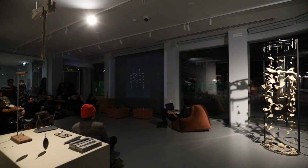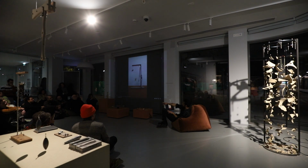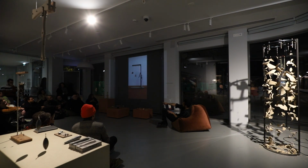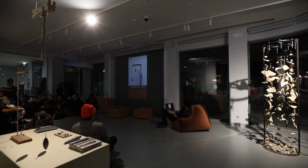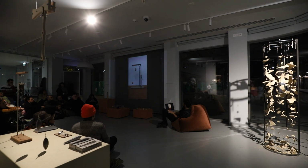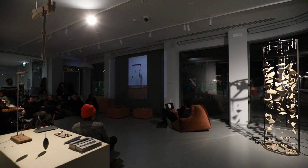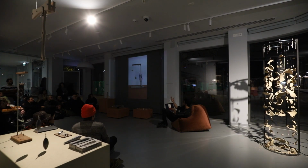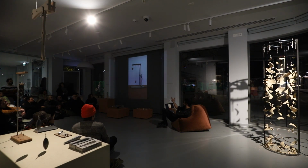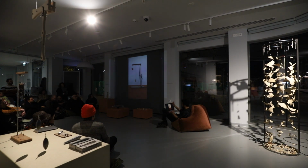So it's just a way how ideas connect in my mind. So then it's the question of how you do this. So I made this little machine. You can also see that there, actually. I don't know why I'm playing the video, but it's just right there. So I made this machine to go from basically the movement of a motor, which is just rotational movement, to linear movement of these pieces going up and down and against each other in opposite velocities, let's say.